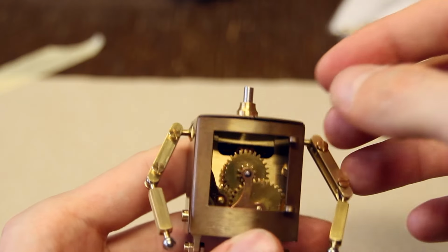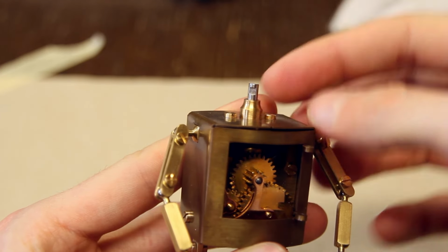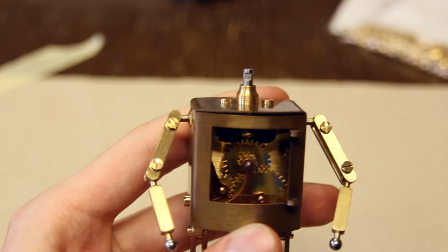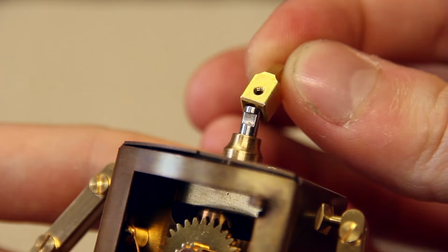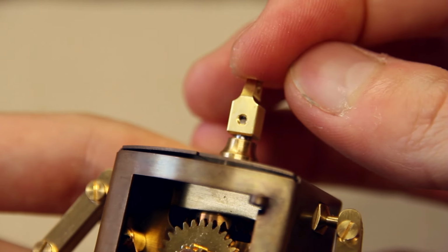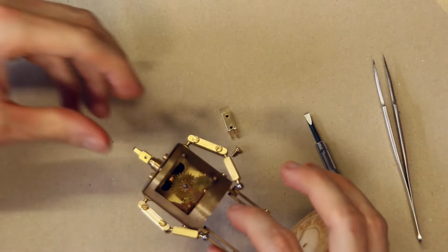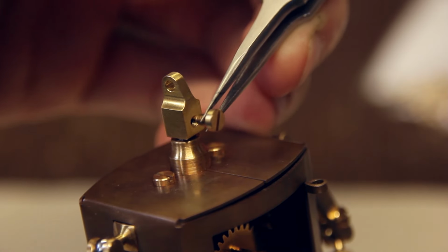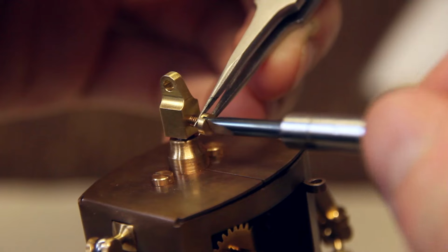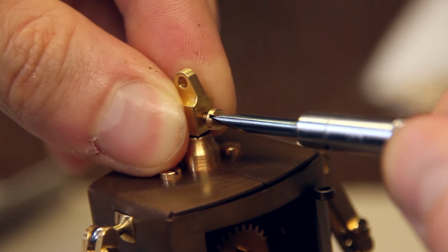So we start with this, and first we rotate the head axis until this little flat spot on the robot points in front. And then we take the little piece and put it over that rod, press it thoroughly down and make sure the orientation is correct, so the little threaded hole lines up with the flat spot on the axis. And then we take the short screw of the two, the 3mm long screw, and screw it in that little thread and gently tighten it like this.